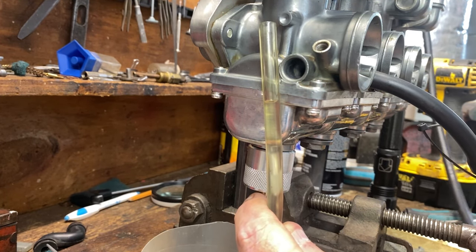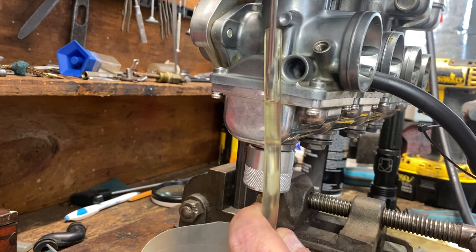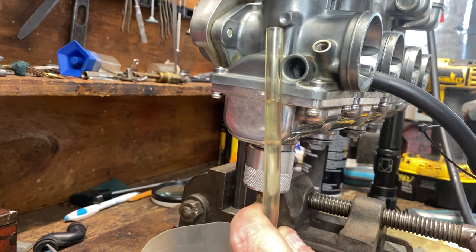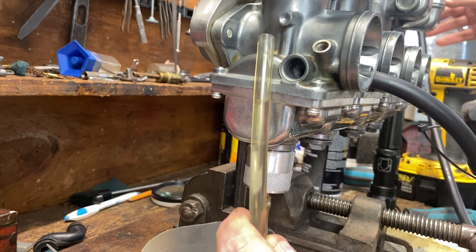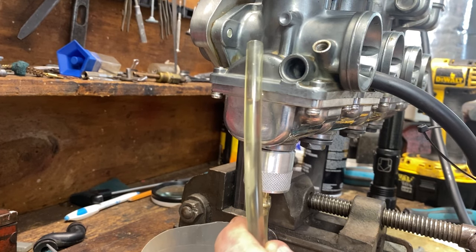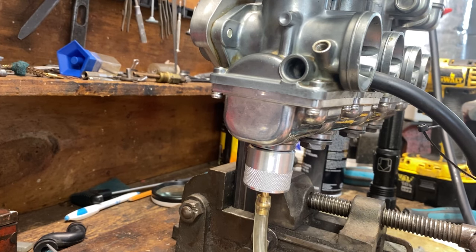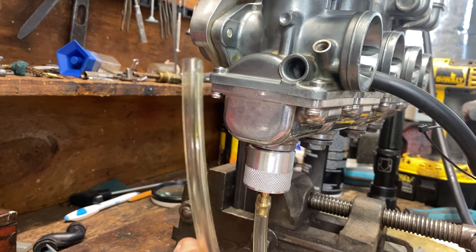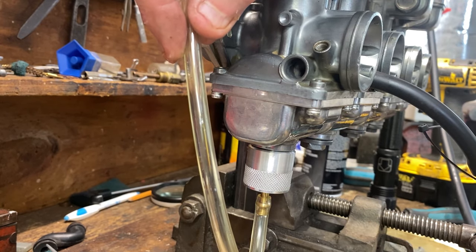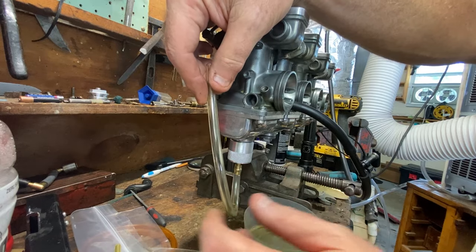Let me go ahead and fire this carb up with some fuel and you'll see it start to rise. We got a bunch of air bubbles — you can usually get that air bubble to go back up inside and let it settle out. This one is sitting about where I want it to be, right at that edge of that feature of the carb — about 3 millimeters from where this edge of the carb meets the float bowl. That's a good reading. All four carbs required multiple adjustments, which is usually the case. Number four required three adjustments; one, two, and three required two adjustments each. This is the service fuel level check using the new tool we just made.